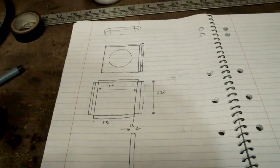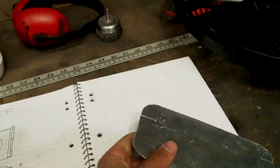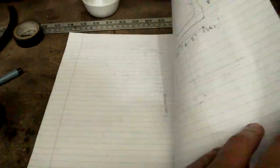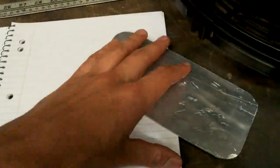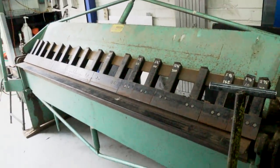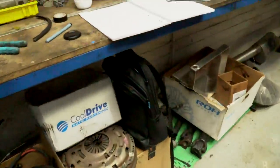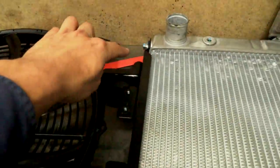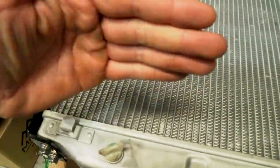I've got a bit of an idea of the design I'm going for. I haven't really used one for a while so I'm just going to muck around with a test piece and figure out how much material is required to fold. I'm going to make it out of 3mm aluminium. On the part design, I'd like to bolt it on the side - one or two bolts here and then for it to come up and sort of wrap around.